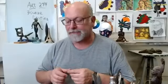If I have a really long, thin stick, I will run a sprue parallel to it the entire way and put tiny little gates and sprue connections between the sprue and the stick, so that the thing looks like a ladder when I get done with it. That allows me to pour the metal really hard, and the metal gets forced in at certain intervals along the long stick, and that allows the stick to fill up. So there are all kinds of gating tricks that I use to make sure that thin, long things can get cast.